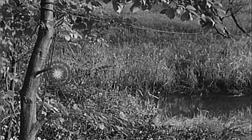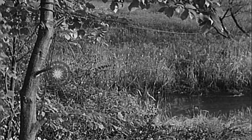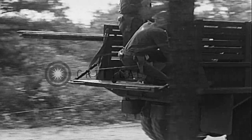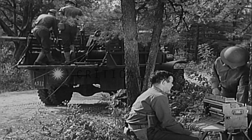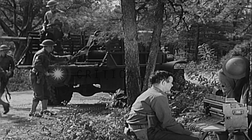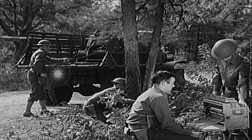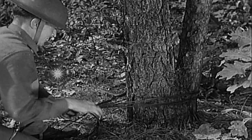Ordinarily, a stream is crossed by an overhead tie, just as in the case of a road crossing, except that the tie need only be high enough to clear the water at all times. While the team members are following up with special construction work, the unit truck arrives at its destination. Enough wire is reeled off to complete any special construction that may be necessary. The wire is tied into a support.